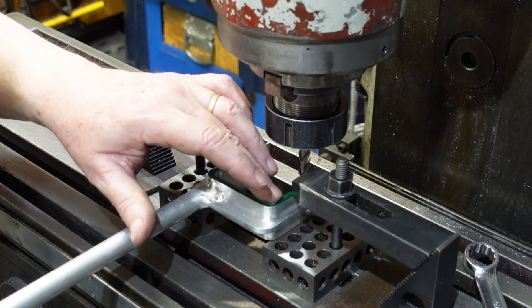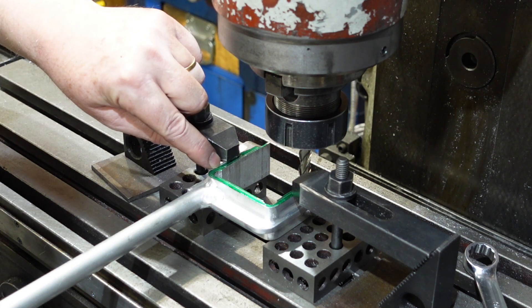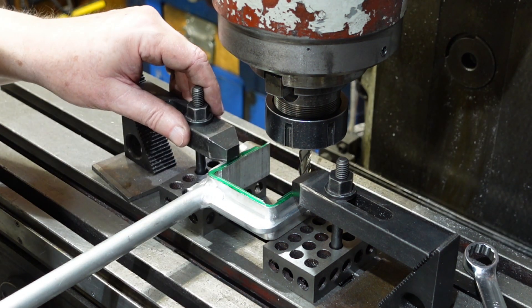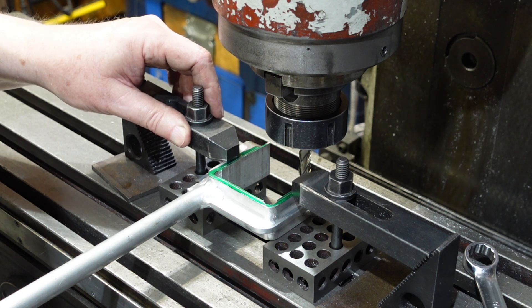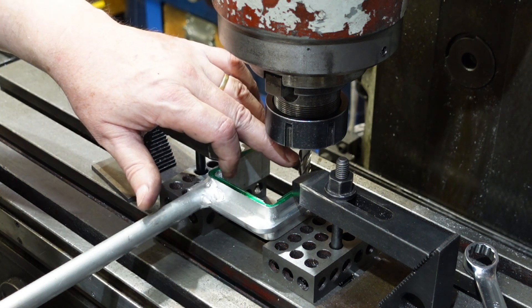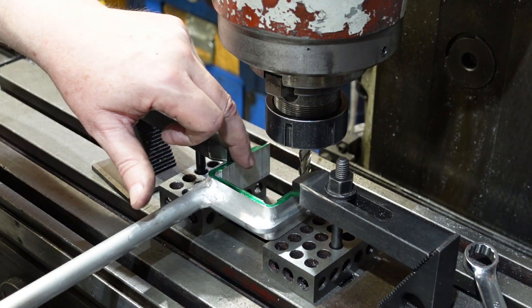I'm about to clean up inside here — that needs to be 62mm for everything to fit. I want to bring these flanges down to about 4mm; I've got some holes there I'm aiming for. This is possibly one of the more stress-inducing setups I've done for a while because that clamp only just clears my scribe line there. So I've got a long series cutter, I'm coming in hopefully not picking up on the 1-2-3 block, and can come along and clean that up.